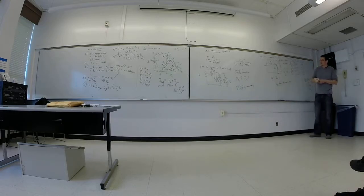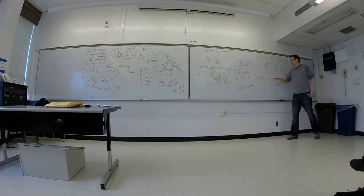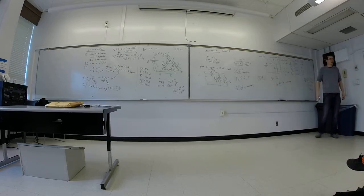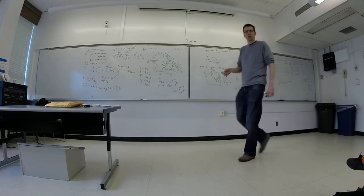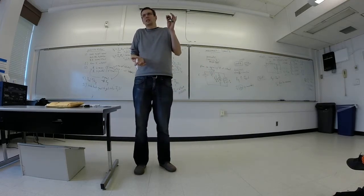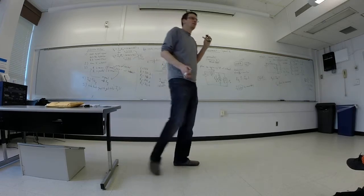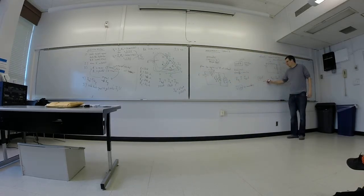So we actually want a high resistance. The voltmeter actually has a very high resistance. That makes that extra parallel branch so unfavorable that it gets very, very little current through it. It just siphons off a little smidgen of current that would have otherwise been forced to go through R2. It just says, hey, I got this really, really hard branch to go through. I just need a few little charges and that's it. Okay? This, again, will minimize the measurement error to something that hopefully is okay. Minimize your measurement error.